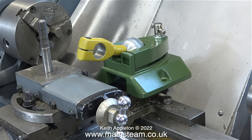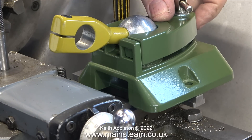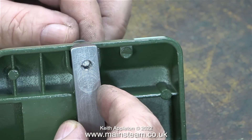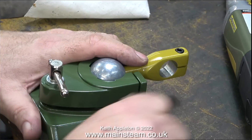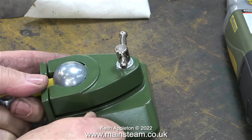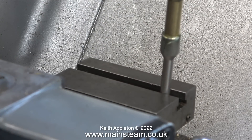What I'm about to do is mark the positions for the holes to be drilled and threaded to accept some M6 bolts, allowing me to fasten this unit to the T-slot. For this job I'm using my deep hole marker — a very useful tool. I didn't bother showing the threading operation as it was very straightforward: I drilled a couple of holes and tapped them M6, screwed the bolts all the way in, chopped them off on the bandsaw and then ground them flat. Before grinding them flat I made sure the bolts were really tight, because I didn't want the eventuality of the bolts putting pressure on the bottom of the T-slot.